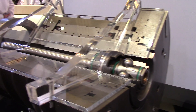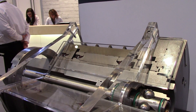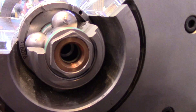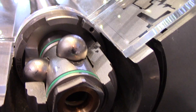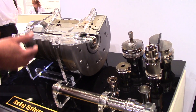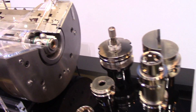The key to making a spindle connection the most that it can be is adding higher bending moment and higher bending stiffness. What the higher bending stiffness does is it allows you to stay in the cut longer, because you don't create any sort of angular forces inside of the spindle, so it wants to continue to rotate. With a high bending moment, you do not deform the spindle connection, which puts pressure on the bearings in the spindle.